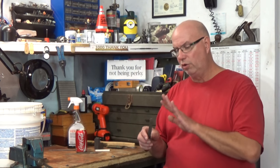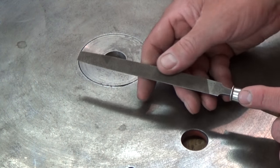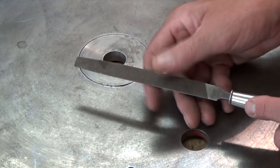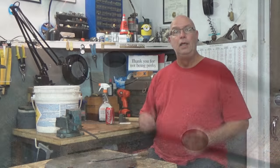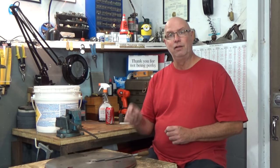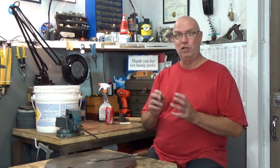Let's take a closer look at this file. If I look at this small half-round file I note that there's a shine to the surface that indicates the teeth are rounded over, and when I rub my finger on it in either direction I get about the same feeling — something that is not trying to bite into my skin. This is definitely a dead file. The file that is nice and crisp and sharp will be matte and dull in appearance, while a file with a lot of shine has dulled and rounded-off teeth. So a matte file looks sharp and a shiny file looks dull.